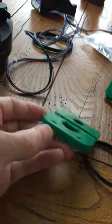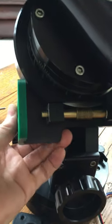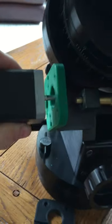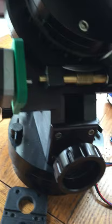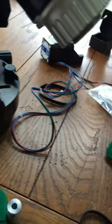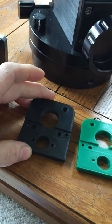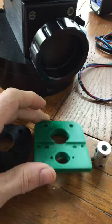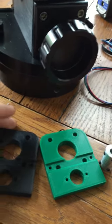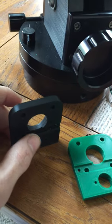There are a bunch of different 3D-printable brackets out there. This is a pretty simple one that you can print — it just literally goes right there and your motor goes right in there, and that's that. Nothing wrong with that. They're recommending printing it in ABS and not PLA, which makes sense because obviously PLA is going to get soft whereas ABS won't. So print that out in ABS.